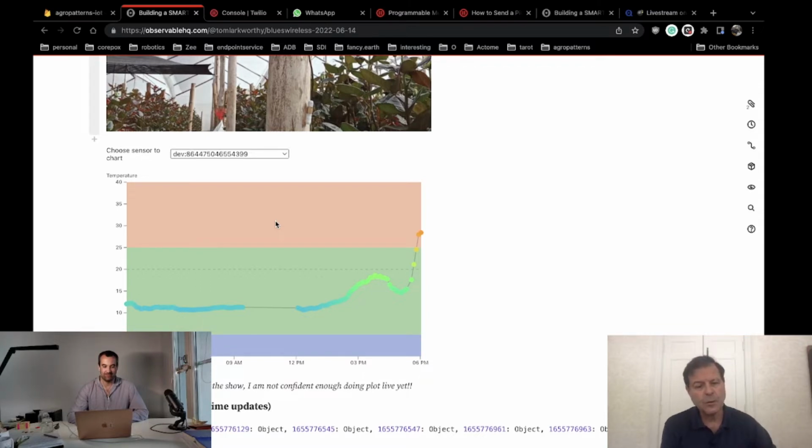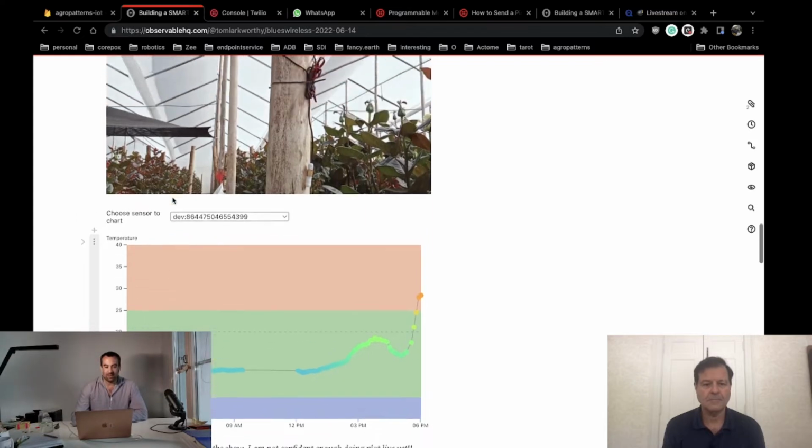At that point, what that person has to do is, these greenhouses have curtains, and they also have industrial size fans. As soon as the temperature goes above that green zone, you really have to open up the curtains, turn on the fans and open up the vents above. That creates a huge flow of air, which really brings the temperature down, but it also dehydrates the plants. Right. And it lets the insects in. Oh no. So that's why it's relevant to always be monitoring for the presence of insects and disease. Yeah, this forms like an industrial control process.